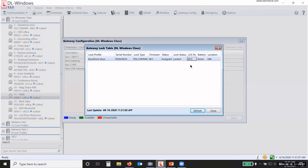See how my numbers change? Radio frequency is a wave. I meant to say this earlier. When we were talking about signal strengths, a radio signal is a wave. So you have high points and low points. Your signal strength, when you get it, could be at a high point, and if it's a 26 at a high point, it's going to be below 26 longer and more time than it is at that 26.